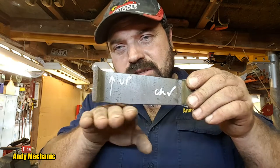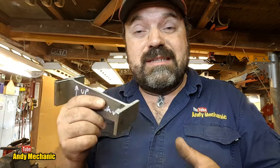That's basically everything made up now. I can't think of any other plates that I need for this next beam to go in, or at least test fit further down the workshop. I've still got the feet to weld on, but I'm going to weld the plate that goes at the bottom here first. That's tomorrow's job, and then the feet get positioned separate to the beam once the beam's up in the air and supported. These get slid in, everything's double checked, and then they're tacked into place and welded properly once the beam's taken back out, cleaned up, ready for paint.